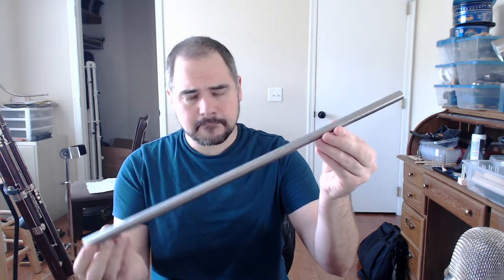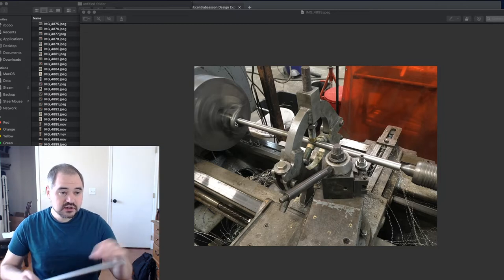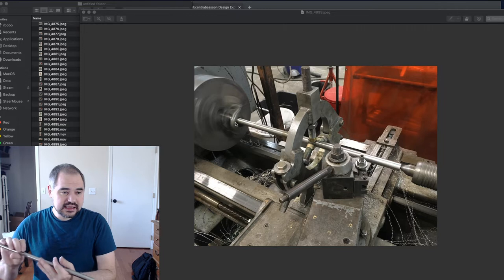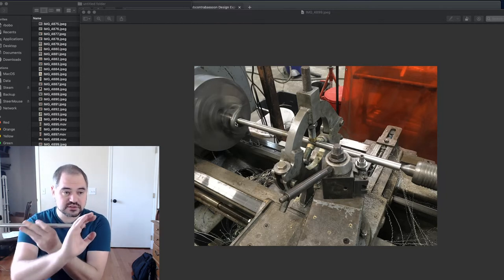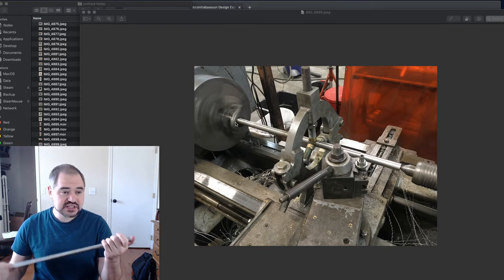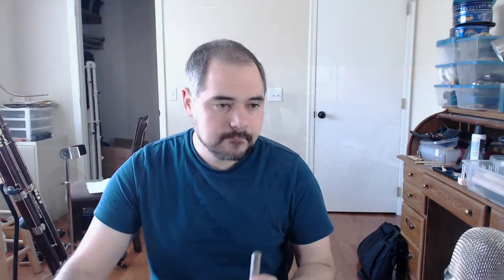This is one of the mandrels — the third of the tube mandrels. Someone asked how I kept the work engaged. You can buy what's called a lathe dog or lathe carrier — it clamps on the end of a piece to be turned between centers. The dog has a little hook that catches one of the chuck jaws, so you're using the chuck jaws to drive the piece but not relying on it for concentricity.